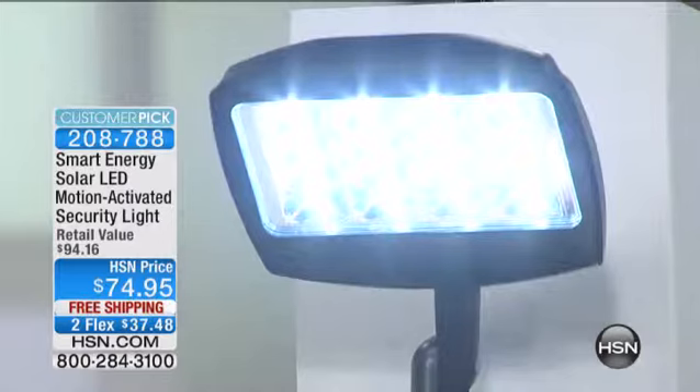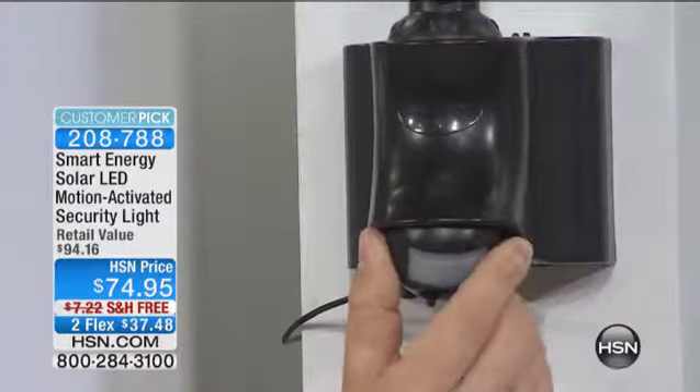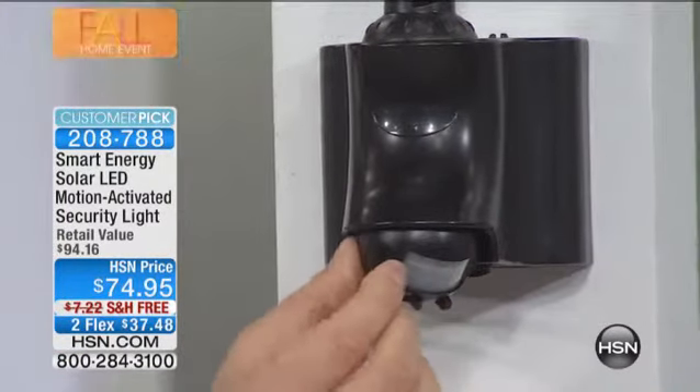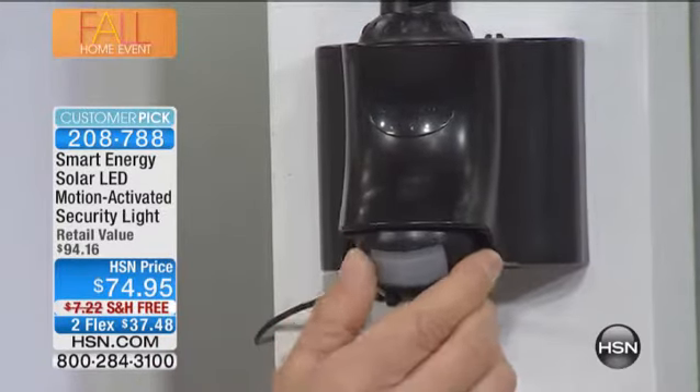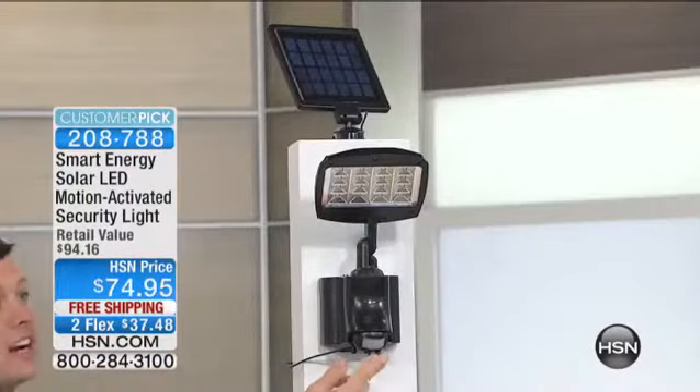You can see me covering the little sensor down at the bottom. This sensor not only articulates back and forth, you can twist it to the side if you want it to sense motion from one direction or another — just kind of twist it back and forth. It senses not only light and dark, so your light isn't going to come on until after the sun goes down, but it senses motion as well. So the light will stay off until it senses that something has moved in front of it. You can adjust the sensitivity — if you don't want it coming on every time the cat runs in front of it, just turn the sensitivity and it'll look for something bigger, look for more action. If you want it to turn on when a human being walks in front of it, sensitivity adjustment right there — very simple to adjust.